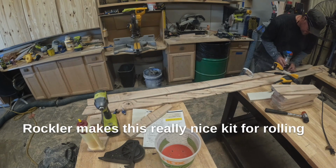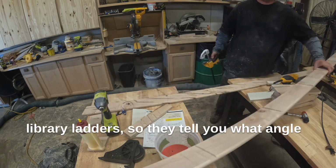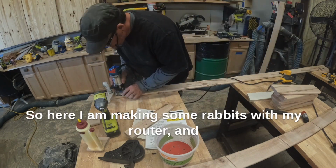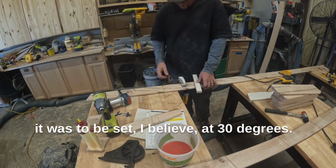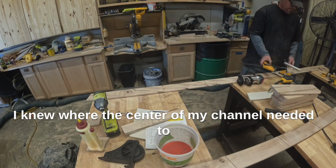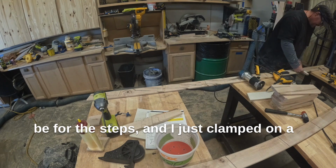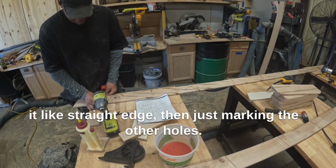Rockler makes this really nice kit for rolling library ladders. So they tell you what angle to set it at, etc. So here I am making some rabbets with my router, and it was to be set, I believe, at 30 degrees. Made a really simple jig. I knew where the center of my channel needed to be for the steps, and I just clamped on a small jig on the side and ran my router across it like a straight edge.